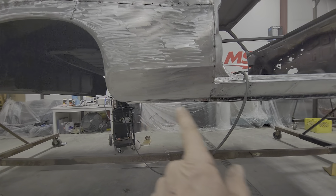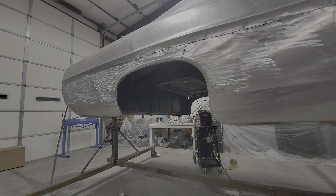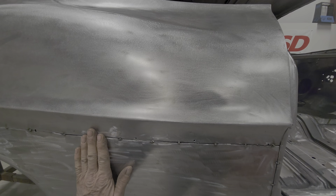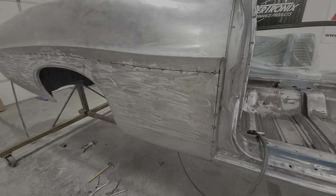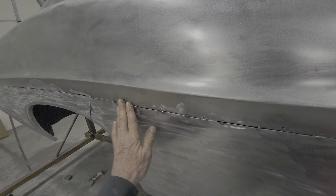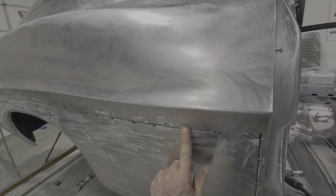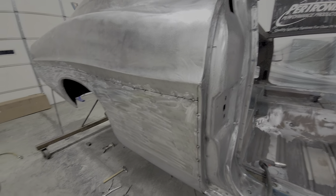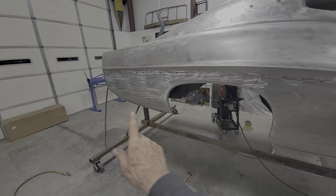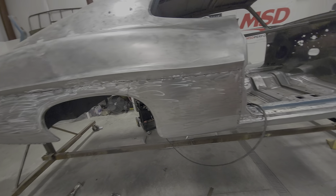Same plug welding — I've already ground a few of these up here. Butt welding: Fitzy and others showed me to take this panel, weld it, spot it right onto the outside of my car. I had it a layer too thick there, so basically you take and spot that on there every six inches. I'm down to about three or four inches now, but initially I had about a six-inch pattern going all the way down the quarter panel, just stitched on there.